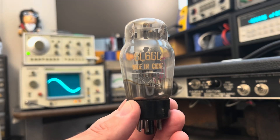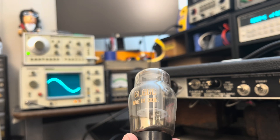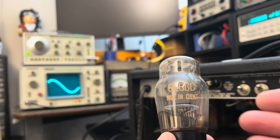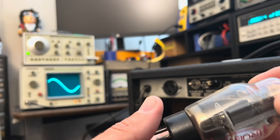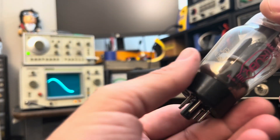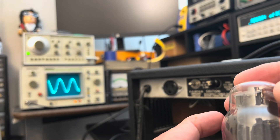This is a good moment to bring up microphonic tubes. When people refer to microphonic tubes — be they your 9-pin preamp tubes or these big octals — you're talking about noise that is transduced through the envelope or the internals of the tube through the circuit electronically. The thing becomes a microphone. Listen — you hear that rattling sound? That doesn't always equate to microphonics or a noisy tube, but it often does. You shouldn't hear anything. This tube is incredibly worn out.